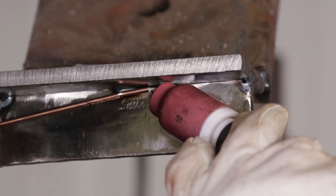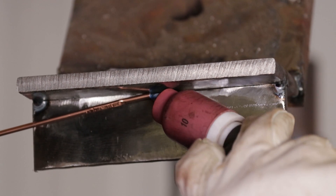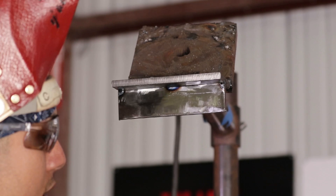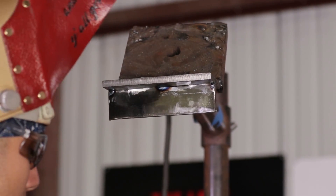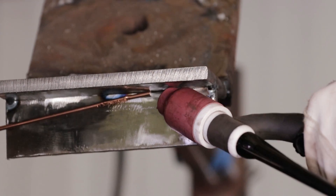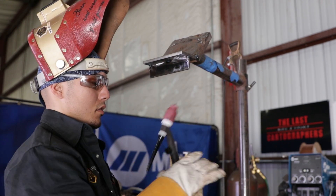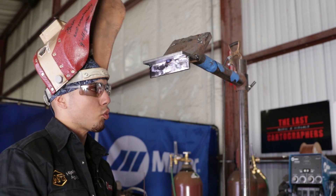Make sure to keep your wrists relaxed, your hands relaxed. Keep that filler wire in the middle of the puddle at all times, all the way through. If you're going to do the hot pass, you can just go over here. We're running at 150 amps for the root pass and around 185 amps on the hot pass. You can do it this way, this way, or this way — kind of wrap it around and wiggle it all the way. So I'm giving you three different variations on how to manipulate that TIG torch by wiggling it. It's not just one specific way — whatever you're comfortable with. This is all just a root and hot pass basic tutorial — simple and sweet. I'm running at around 35 CFH on the bottle, 100% argon.